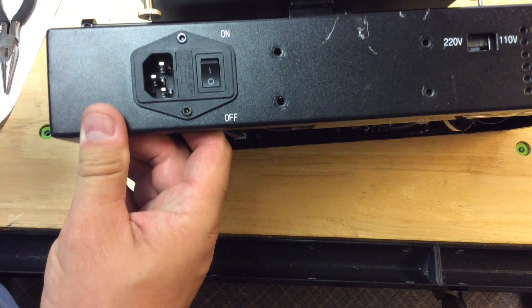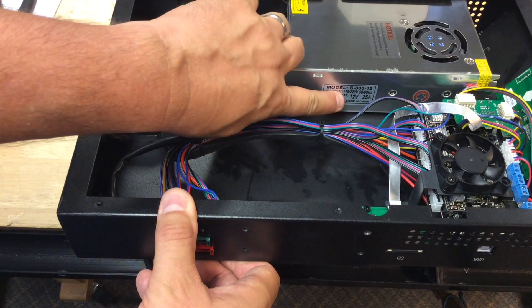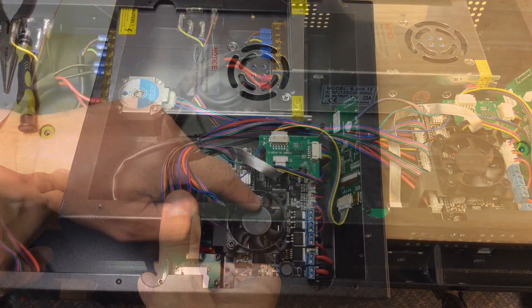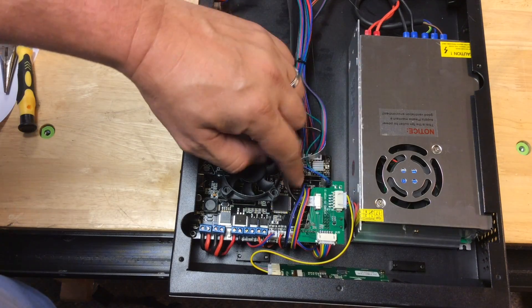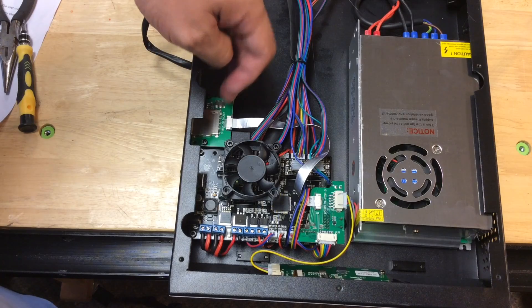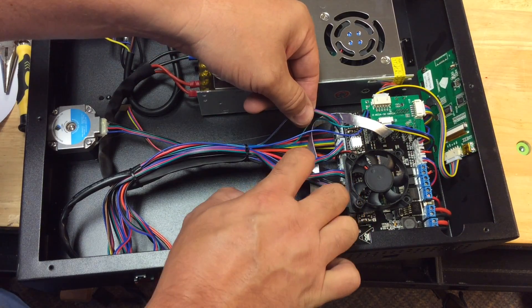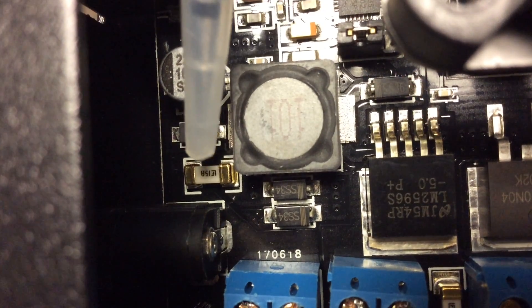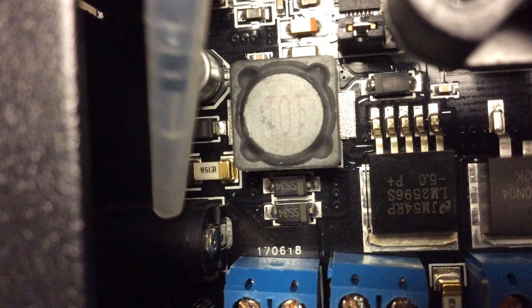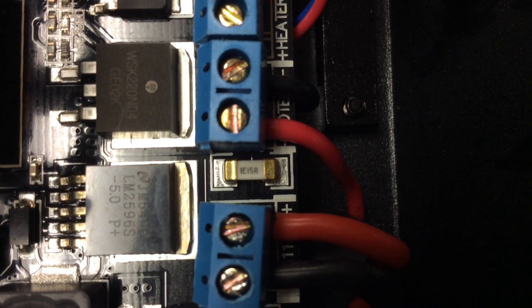It's got a plug and switch on the side along with a fuse. When I popped it out and took a look, it's a 5 amp fuse, so it's well done from that point of view — it looks pretty safe. Inside it's got a 12 volt 25 amp supply, so plenty of power to heat the heated bed. It's got a fan that blows down on the board and an LCD touch screen display, with a ribbon cable going off to the SD card separately. The board itself looks a lot like an MKS base, wired really nicely, including two extruders wired even though only one is on this machine. I did find a fuse on the board over by the power connector — a 15 amp fuse that if it blows you've got to re-solder a new one in.